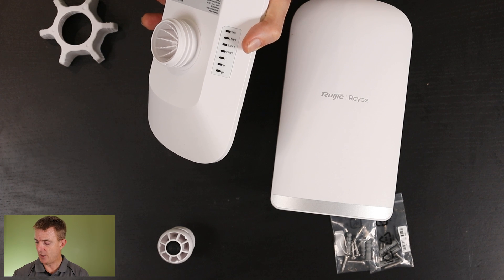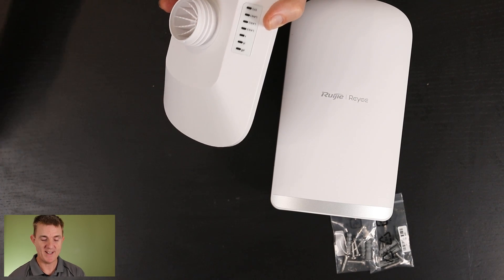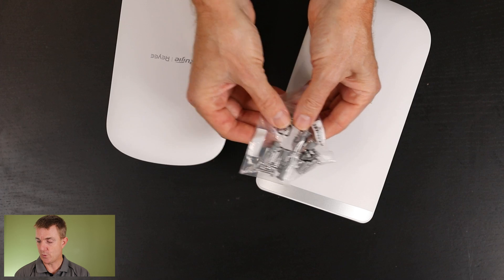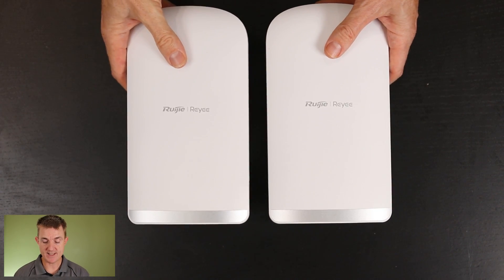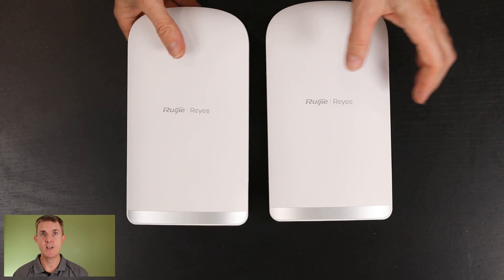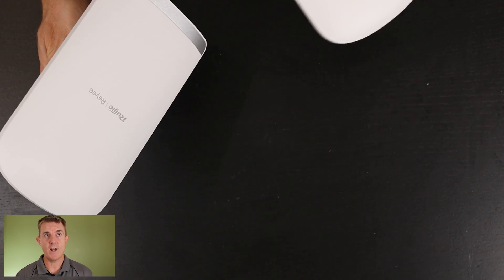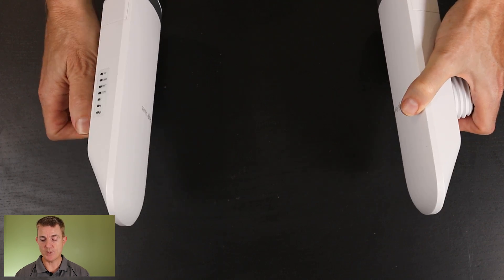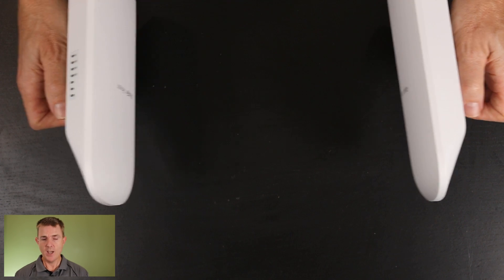You're going to get your collection of screws and lugs to be able to mount all of that together. Then you're going to get your two devices themselves. These are designed to be point-to-point or point-to-multipoint. Out of the box, these are paired with each other — the first one can go on building one, the second one on building two, looking at each other. These will then create a point-to-point wireless bridge up to three to five kilometres, depending on your environment.